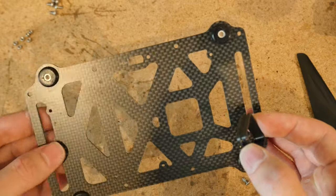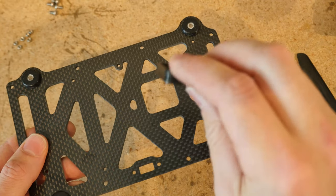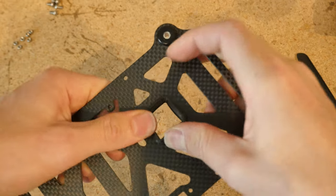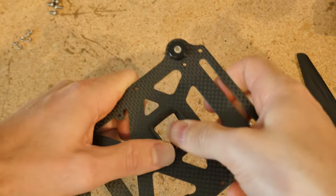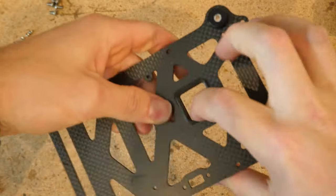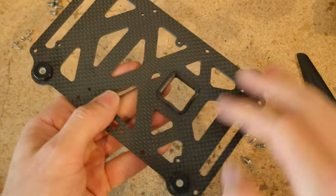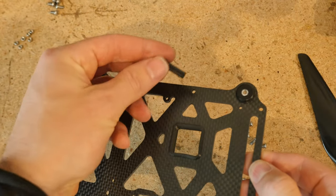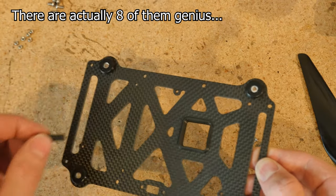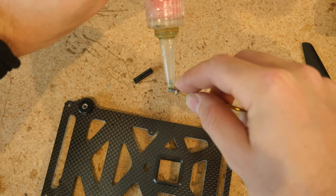The orientation of the bottom plate does matter — have it oriented like so. Make sure the ledge on the gasket is on the bottom, then force this thing down into that cutout. You'll have to bend it a little bit. Inspect the grooves such that it's fully seated. Next, install the 20mm standoffs — there are eight of them in all eight M3 hole locations. Use an M3 6mm button head screw and definitely apply Loctite to these. Remember, this is the top of the bottom plate, so insert the screws from the bottom since the standoffs face upward.